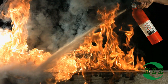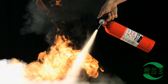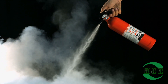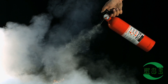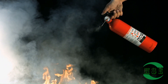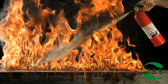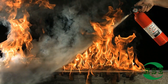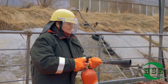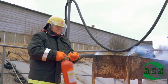Damage from dropping can damage the integrity of the extinguisher, so it is very important to keep a dropped fire extinguisher in a safe and isolated area. Why is fire extinguisher pressure low? Like an old or worn car tire, a fire extinguisher can develop a slow leak that releases the gas — this is called depressurization. This process can be due to a leaky or damaged valve component such as an O-ring seal or valve stem. We hope you understand what the purpose of a pressure gauge in a fire extinguisher is and how it works.